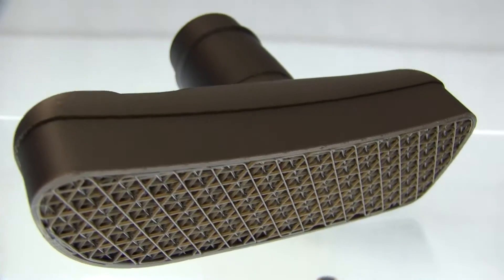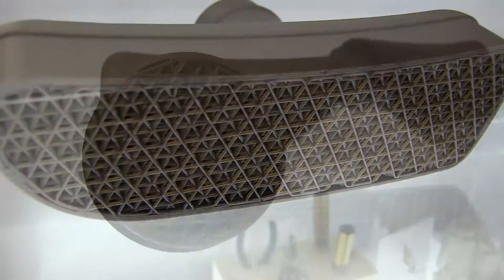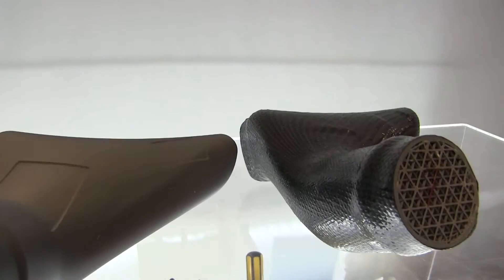We've developed a new infill pattern to both decrease your build time and help aid in the dissolution process after you've cured your composite. The material supports higher temperatures and higher pressures — capable of up to a 250 Fahrenheit cure, up to 90 PSI at temperatures of around 210 Fahrenheit.